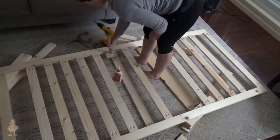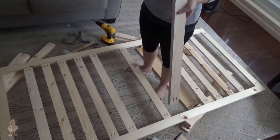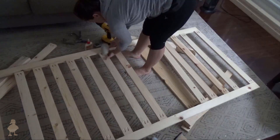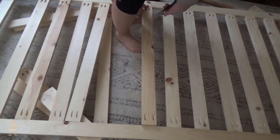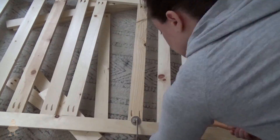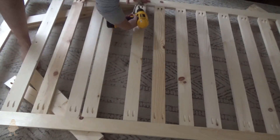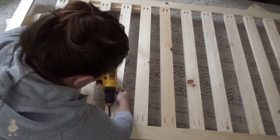Because this plan relies on sections, you can choose to build the slats first if you wish. We started with the base but forgot to bring out the video camera for that part. Next I assembled each half of the bed slats in the living room because we hadn't moved the existing bed out of the bedroom yet. Spacing to exact measurements was not a priority of mine, even though I do recommend it. Each slat is attached using pocket holes and a little wood glue, and I recommend using a face clamp if you have one available to help hold everything together.